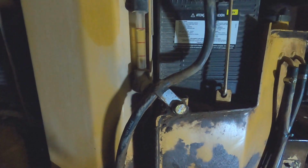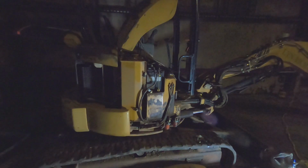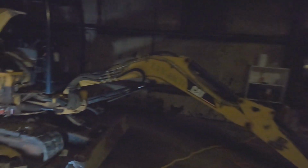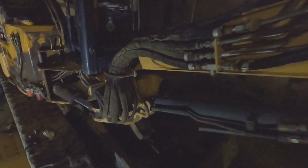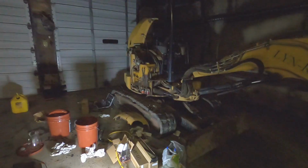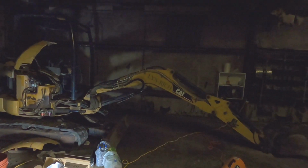And we are just below that. I'm gonna leave it there. It's probably a teeny bit high, but also keep in mind that we are fully extended. And I also have a hydraulic leak on the blade cylinder, which can be replaced. So I'm gonna lose a little bit of fluid between the time I replaced that and now. So I'm not gonna worry about pulling any out. We're gonna leave it like that because I'm gonna leak some fluid between now and 2 weeks when I can have the time to replace the seal on that cylinder. So we're gonna leave it a little high.